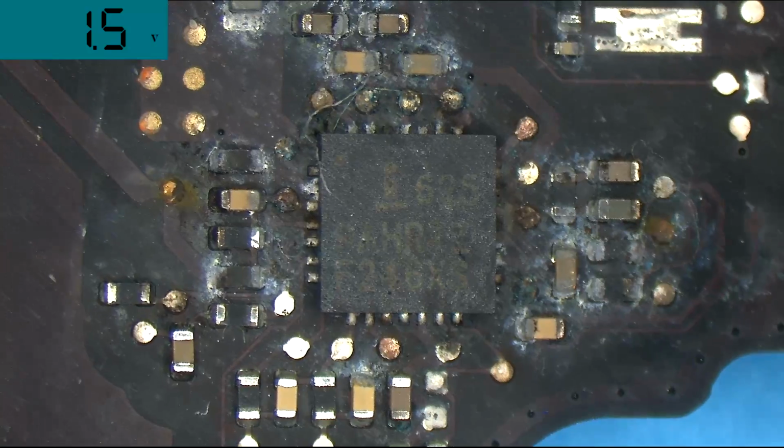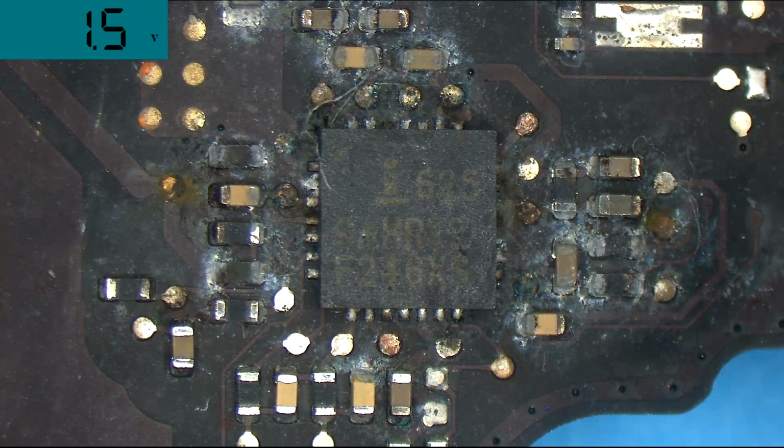Yeah, that's an interesting amount of durability there. And our traces are a little bit too corroded. As you can see, we've only got 1.5 volts. Oh, hey, Jessa. Wow, did you seriously just appear as I was saying that? Anyway, so this is only getting 1.4 volts. It's actually not drawing any power from the power supply anymore. This circuit is done. The only reason that you see anything is because there is power stored in the capacitors from when the circuit actually worked.